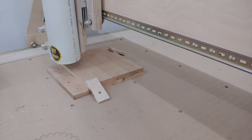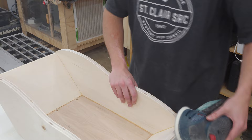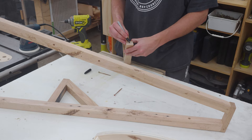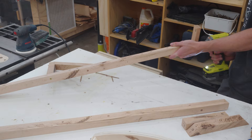The wheel was finished being cut off camera because my battery died. The last thing to do to the barrel was to drill three drainage holes in the front with nicely countersunk edges, before moving on to sanding all the parts of this project with my random orbit sander. In order to sand the legs they needed to first be disassembled, and I made sure to mark which pieces went together for easy reassembly after sanding. This is when I found out that the brad nails from earlier really should have been a clamp instead.